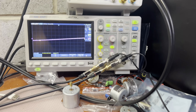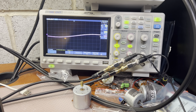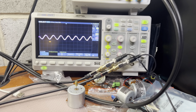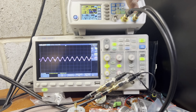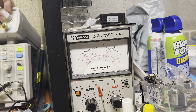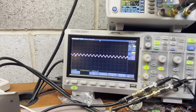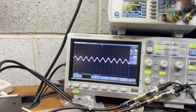The needles don't move up to 21kHz. At 1kHz — needles are there. At 10kHz — needles are there. At 15kHz, see how well it records in phase. At 20kHz — needles there. Type 1 tape: minus 1dB at 21kHz, minus 3dB at 22kHz. Let's see 23kHz, 24kHz — no amplitude modulation, nothing. Everything is super fine, it responds and records very linearly. Really really nice deck.